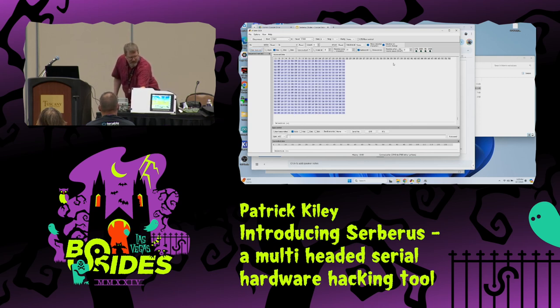And then this is the attitude heading reference system. Basically, that's the electronic gyro of the avionics. It's basically telling it its orientation relative to the ground and how quickly it's changing. Now, it gets its truth also from the compass, which I have a connector to, but maybe right here at the end, we'll try and connect to that and see if we can get both at the same time.